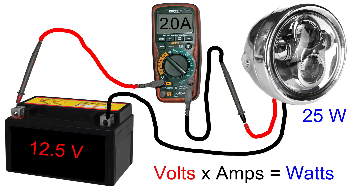Next I want to find out how much power the headlight takes. I set my multimeter to amps DC and the electricity has to run from the battery through the meter to get measured before it goes into the headlight. My battery isn't fully charged and has about 12.5 volts. Voltage is a measurement of electrical potential similar to water pressure in a hose — it's how strong the electricity is. Amperage is a measurement of how much electricity there is, basically how many electrons move through the wire, similar to the volume of water measured in gallons or liters. Watts is a measurement of power: volts times amps equals watts.